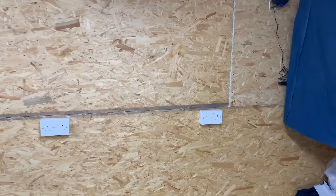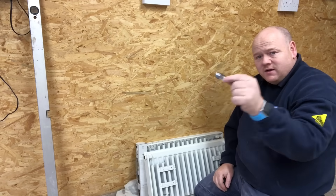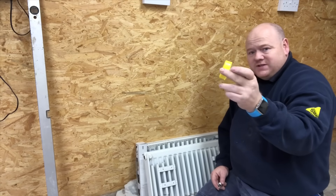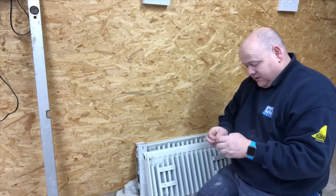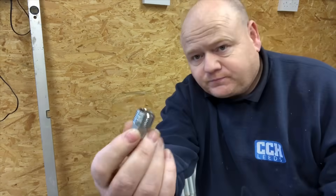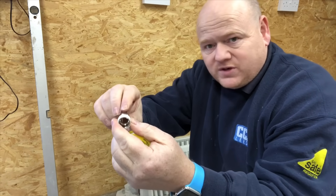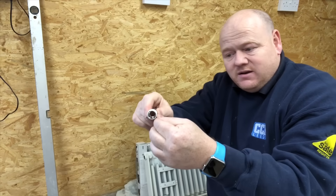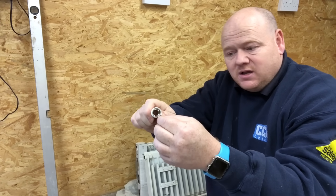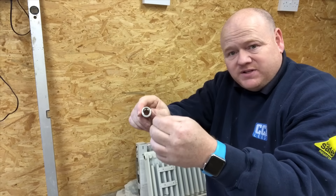We're going to put some radiators on this wall here. Phil and Danny have opened the radiators up and I'm just going to show them how to put the tails in for the radiator valves. If you use PTFE — this is actually gas PTFE — if you're going to use PTFE tape, you get your thread and just put the tape onto it. Whichever way it is, when you tighten it into the radiator, it goes on that way so that as you tighten the tail in, it's tightening the PTFE tape up. If you put it on the other way around, as you're trying to tighten it in, the PTFE tape would just come off.